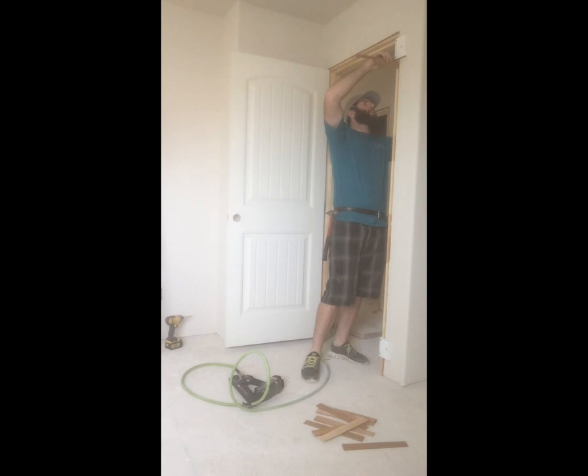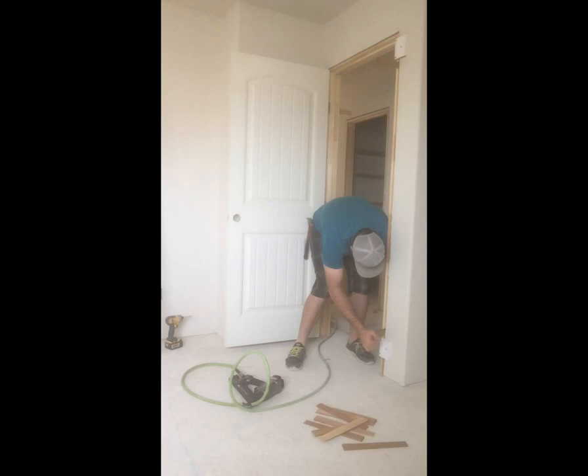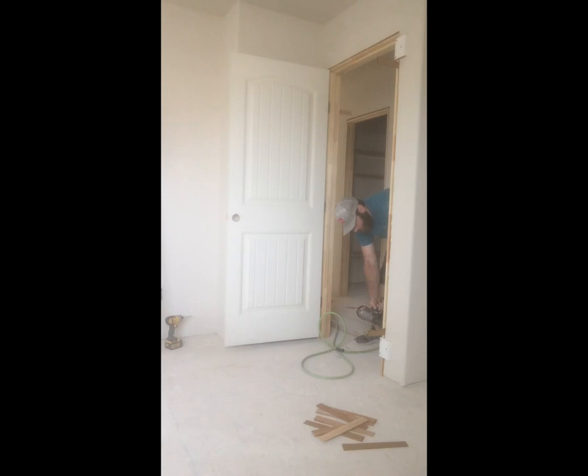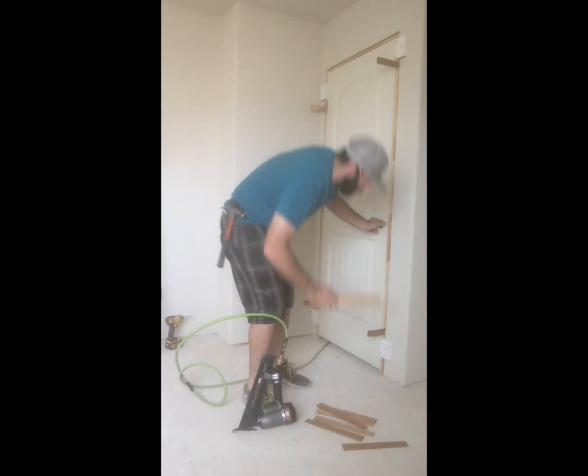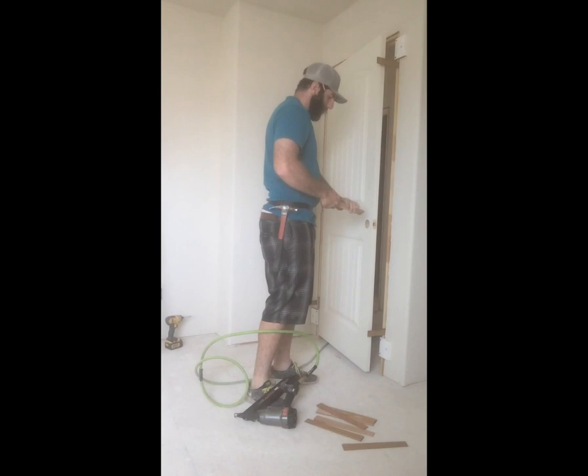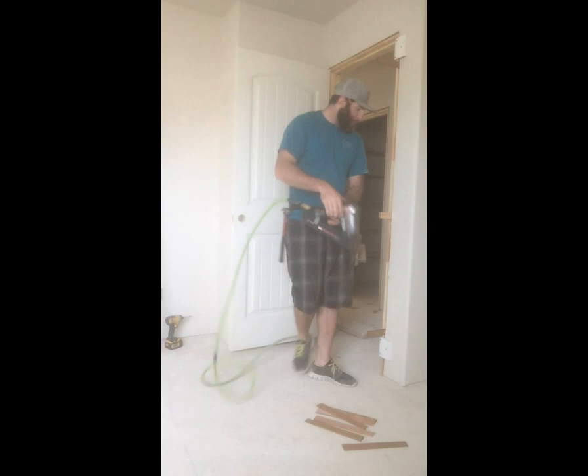On the opposite side of the hinges it's a little different — just do top and bottom, shimming roughly in the same spot across from the hinge. Shoot those in and then close your door. Check that the reveal is all good — close the door, check the reveal in the middle to see if it needs to be shimmed out or sucked in a little bit. Once you get that reveal nice, open it back up and pop a couple nails in.